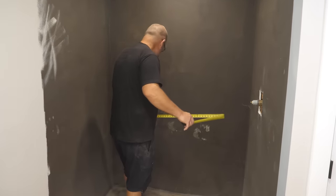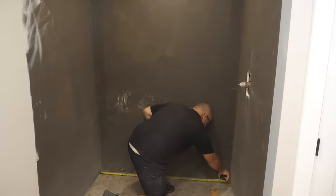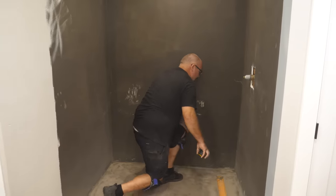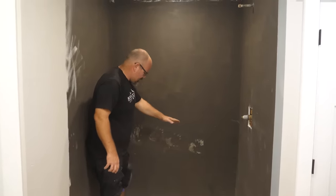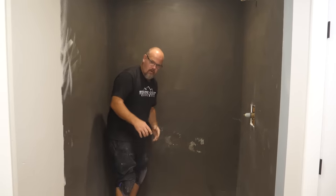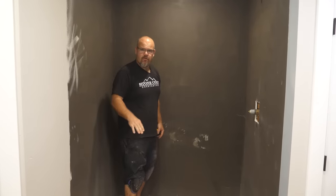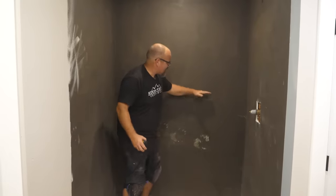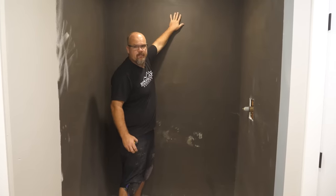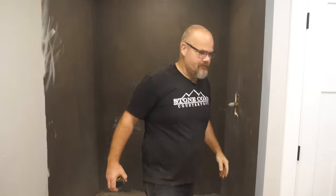So we'll cut these down first width. So I'm gonna go 57, we'll go 57 and a half. That gives me about an eighth on each side. And then I'm gonna jam it tight to the floor. That'll show us our gap. And then we'll just make that follow the floor. We'll actually scribe that, okay? And then once we get that in level, we can then mock our next panel on top of it. So 57 and a half is our first step.